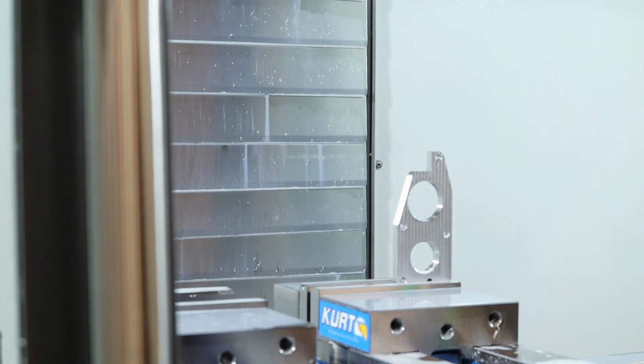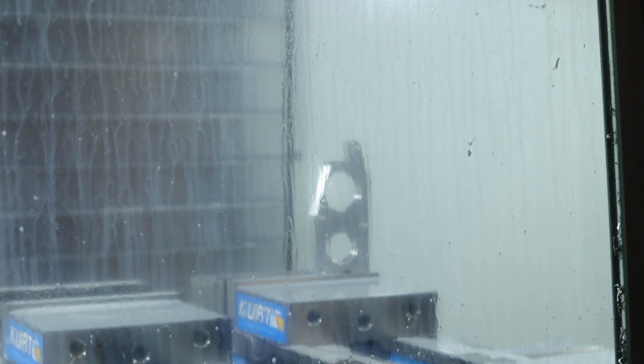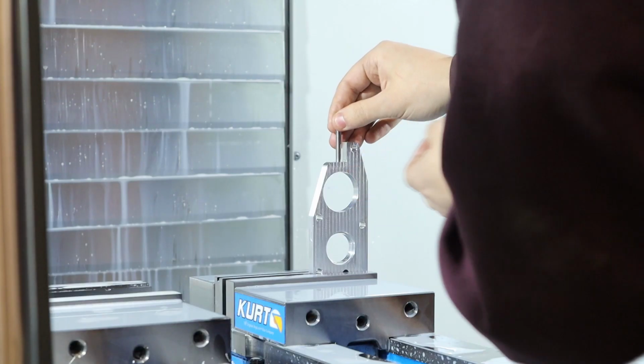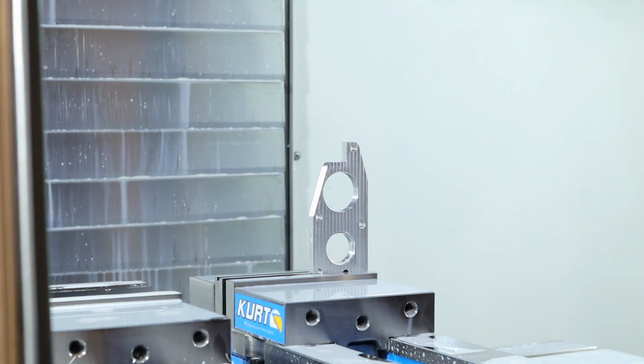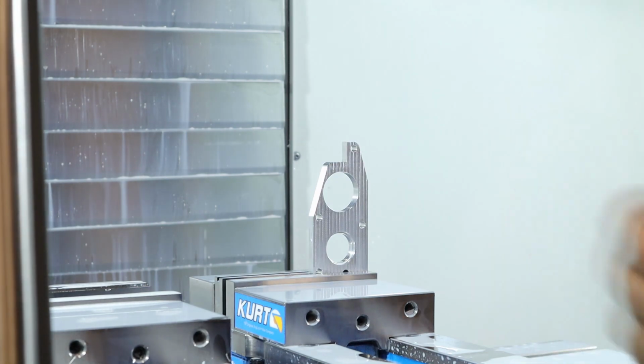Oh yeah, not even 0.2, so we got a ways to go. So let me go set up a contour toolpath and then we'll cut that again. Well, that has done absolutely nothing for us. Let's run that thing one more time. Unfortunately, 215 fits now, so 216 probably fits. So 215, that's the size of the hole, I believe, and the reason it's not going all the way through is because we have that backside burr.